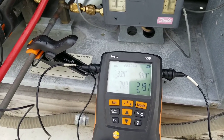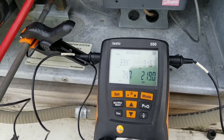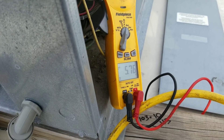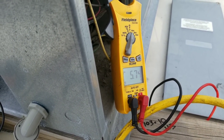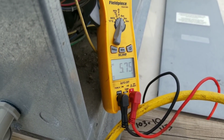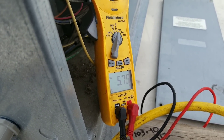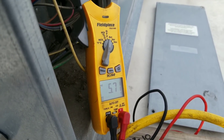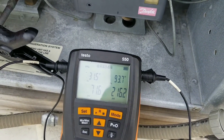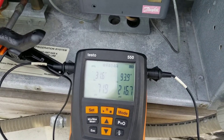I'm going to focus more on my subcooling, which is still around zero. Let's let this run for a little while and see if my box temperature drops. Before I forget — I wanted to highlight the change in our amp draw after getting our pressures up to near normal operating pressures. We were right around 4.6 amps before; we've jumped almost an entire amp, so we're about 5.7 right now. Our compressor is obviously doing more work because it has more refrigerant to move. Looks like my evaporator temperature is dropping, so hopefully that correlates to a drop in our box temp.